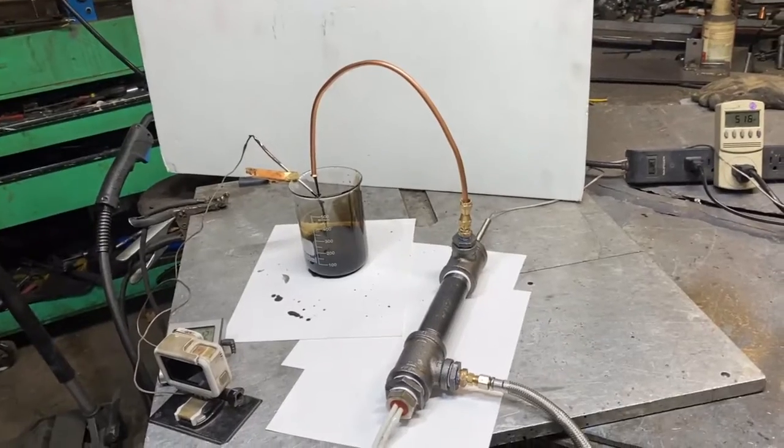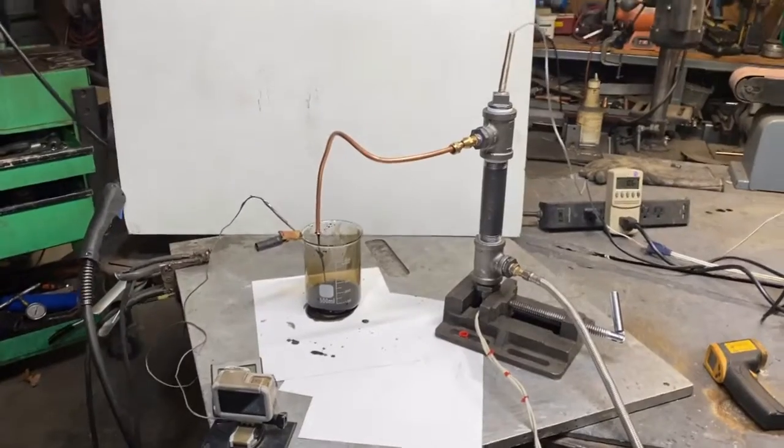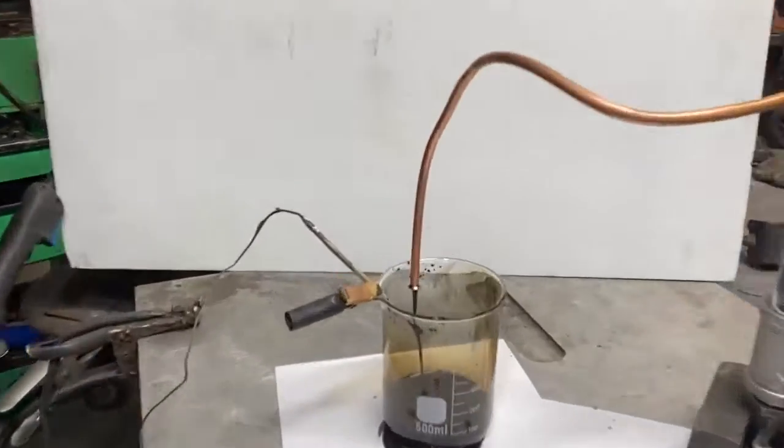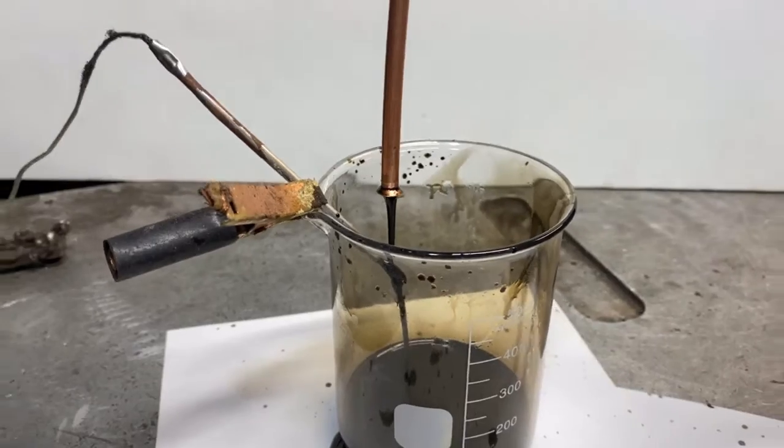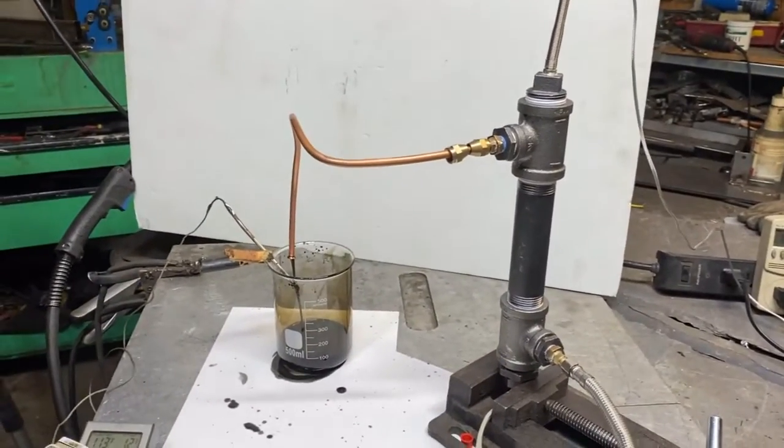We're getting some localized overheating, I think, and some stratification. All right, notice here we have steady flow. There's no entrained flow, no bubbles. That's kind of what you want in life, but I think this burner can handle it.